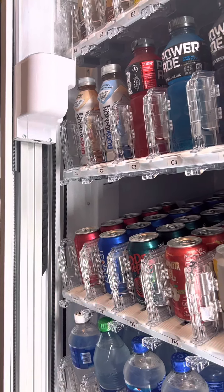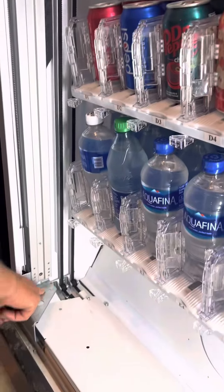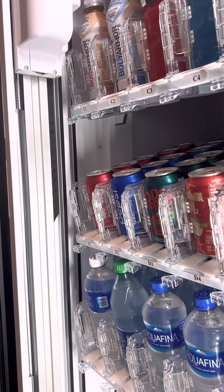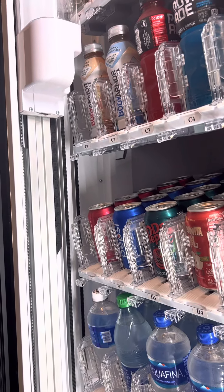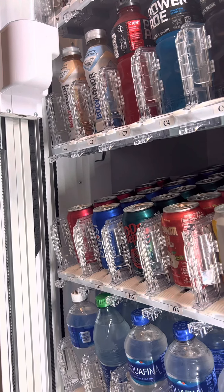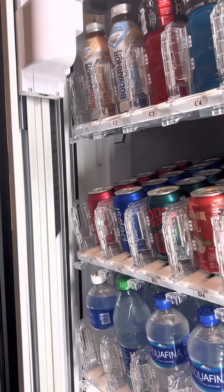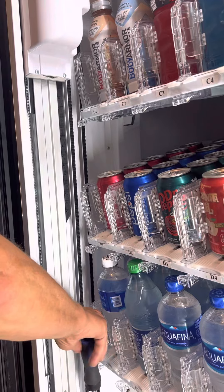The big problem with this switch is if you get a syrup spill, break a can, something spills — it sits right here, gets sticky, and the syrup gets on that switch. If it doesn't release right away when it goes to go up, because that motor encoder starts counting once it leaves home, if that switch doesn't release right away you're going to go too high and not deliver the product correctly. It has to know where home is — home is critical.